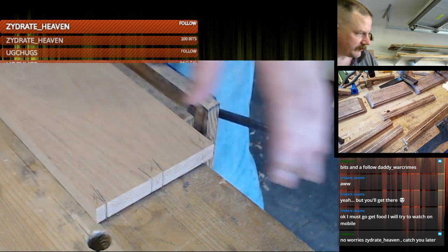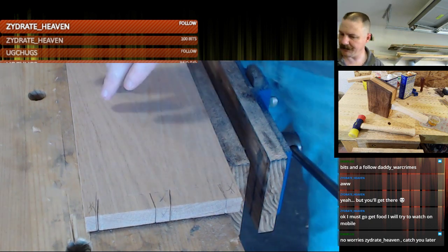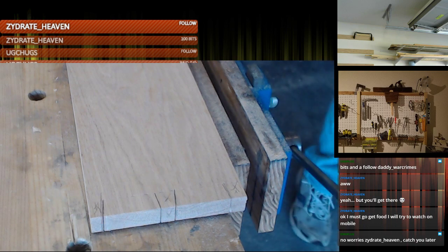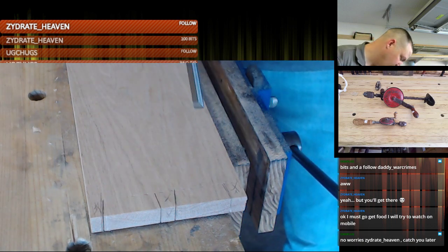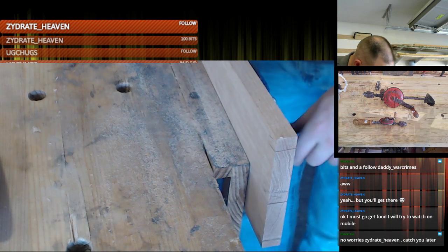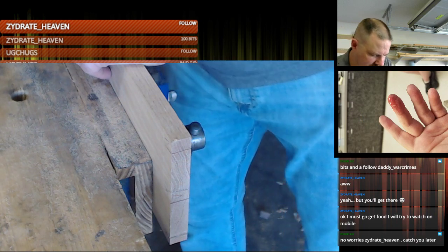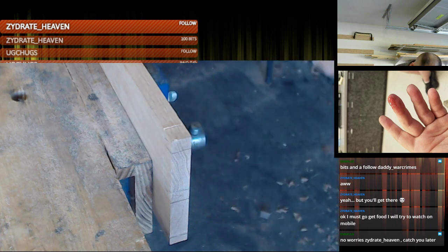Now I've got my pins properly marked, and I've got the tails cut, so that's too big. That's way too big. I've got some more chisels, don't I? How about you? 5/8, I choose you. But first, we can cut sides off here, and I've already got a nice little mark. And so I'll just take a random chisel and make that a bit of a deeper knife wall.